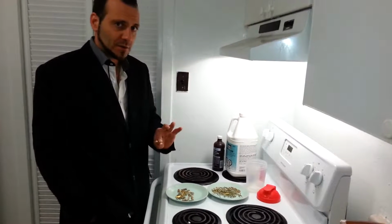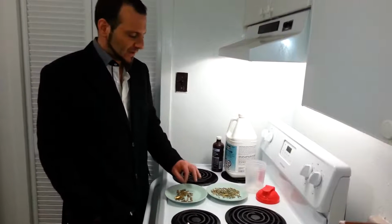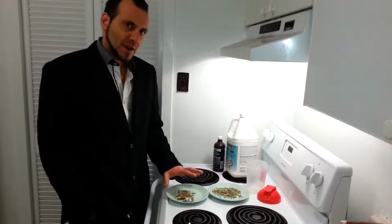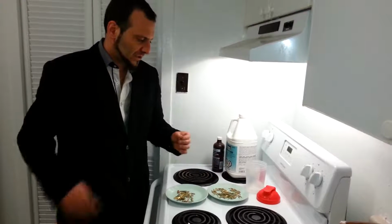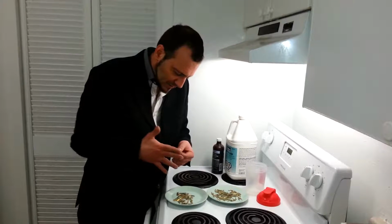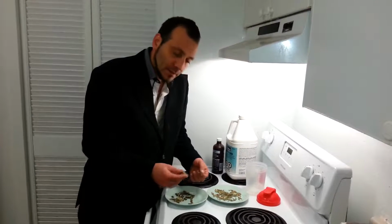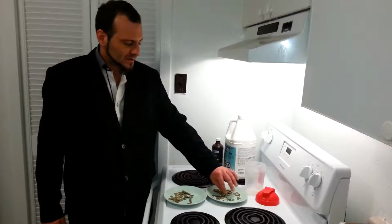So remember, first of all, you're recovering 24 karat gold, sometimes a little bit less, 18, 21, but in some events, you have pure gold. Now the best thing to work with is the RAM fingers. If you take your RAM fingers inside the computer, those modules, you can just take a tin snip and actually cut them very closely. Now if you see, I've done that properly, but you can get any kind of tin snipper. A regular pair of scissors won't work. Go get a pair of tin scissors or one of those sharp pliers, and you should be able to cut it as nice as possible.